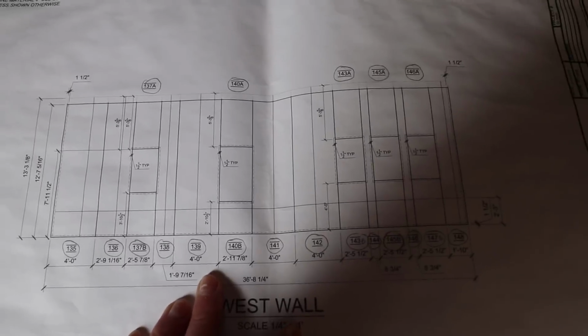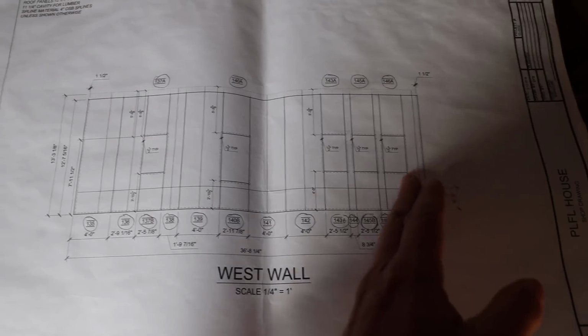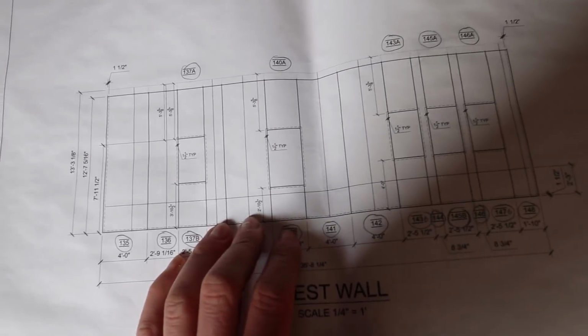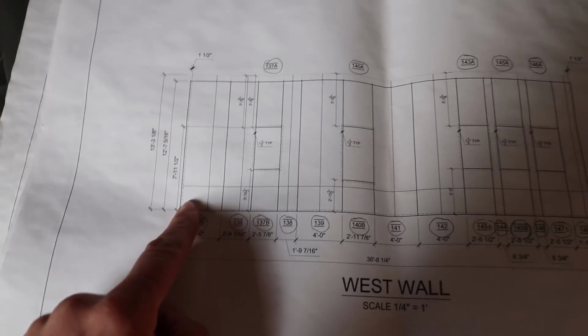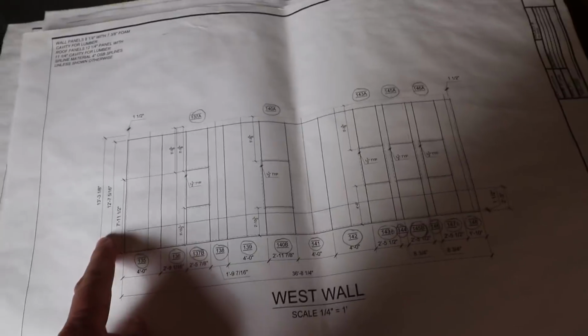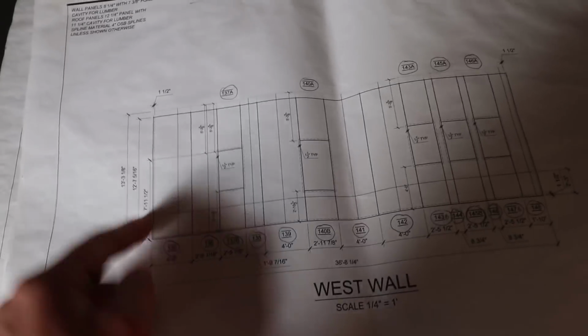When we install a wall, at the advice of Shelter Institute, we start from one side and work our way to the other side. Because SIPs have the tendency to grow like many other building materials, when you put them together there might be like an 1/8 inch gap between them. Sometimes the splines bottom out, so Shelter Institute recommended that we hold the SIPs off an inch so that the last panel on every wall is an inch shorter. So in theory, if our wall grows by an inch, which they said is very possible and happens most of the time, we should end up flush.